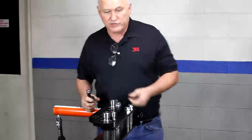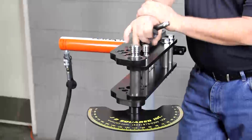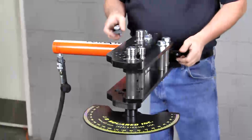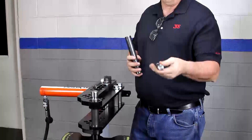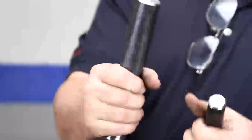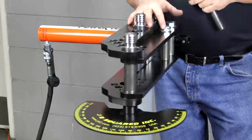Let's go over some of the features real quick. Like the Model 3 and the 32 manual, it has an adjustable degree ring right here so you can rotate it. There's a pointer that bolts onto the die — just a piece of rod that bolts in with a single bolt; you adjust it to zero. This machine is designed with very heavy pins. To give you an idea of the difference: this is the diameter used in the Model 3s and 4s, rated up to about two-inch tubing in the Model 3 and two-and-a-half in the Model 4 at 120 wall. This is the pin in the Model 32 — all 100,000 PSI alloy steel. This pin will allow us to bend extremely heavy material, which makes the rock crawler and truck guys happy. This is one of the only benders in the world that'll do two-inch DOM, quarter-inch wall within a reasonable price.